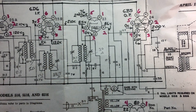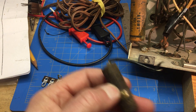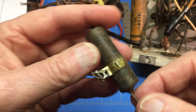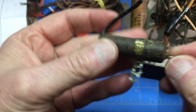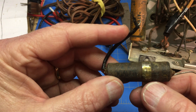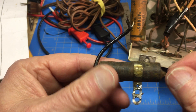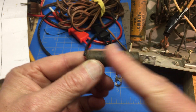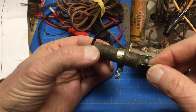After searching and asking Don from Restore Old Radios, and then finding it on Antique Radio Forums — I don't know if it shows up on camera, but it says 'ground' right there on this particular one. The lead that came out of the radio went to the grid of the 6B5 output tube, and the other went to the plate of the 76 tube. The lead labeled 'ground' is common to both of those leads — which totally baffled me. Hopefully this will document it for the future.